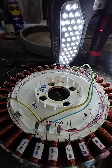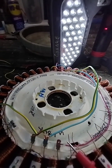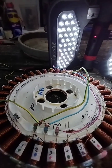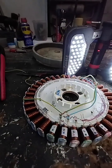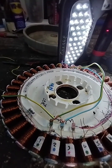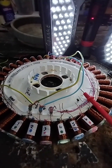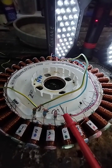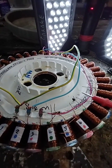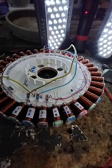Every time you touch this point to this point it confirms a continuous circuit, and that's what we need to test on every one of these bunches of threes — between this point and that point. Do all of your continuity points, because you need a full circuit. If any of these aren't joined correctly it won't run at the correct voltage and you'll end up with a big mess of copper wire. Alright, I'll get on to joining all of these in, neatening it up, and hot glue gunning it into position. See you from Aussie Homesteads — catch you on the next one, bye for now.